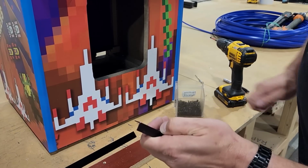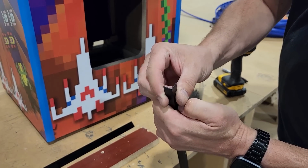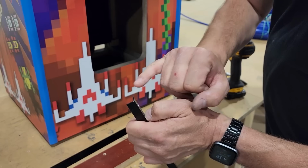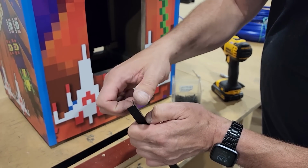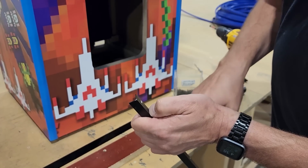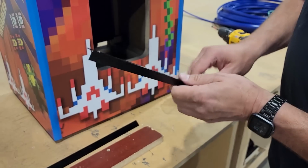It is a little bit wet. If you were to brush it, move it, whatever, you're going to wipe it off for now. But it is seeping into the actual metal for a little bit there. If you don't like the finish when you do that, you can always just take a little piece of emery cloth or really high, like the 320 grit sandpaper we've been using, and just hit it once or twice. Just rub it real light. It'll come off, hit it with some enamel, and then you'll be good to go. But this should be more than sufficient. All right?